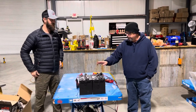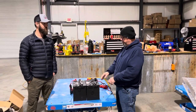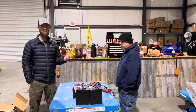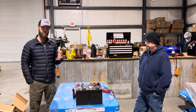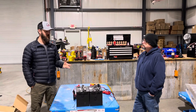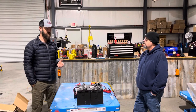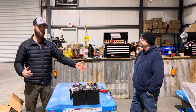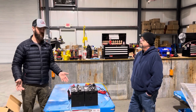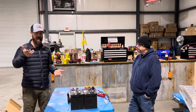Today we're talking about marrying two batteries together — whether you want to wire them in series or parallel, whether you want to increase your run time or need 24 volts out of two batteries. We're going to cover both ways. We're now building systems with the new 24-volt style pumps, and because of that, a lot of you guys are getting our systems with 24s or building your own. This can also be useful if you're running 12 volt — you could expand your battery bank out pretty much as far as you want, still have 12 volts but with a lot longer run time in the field. Really not necessary on 12 volt since a single battery works all day anyway, but it's an option.